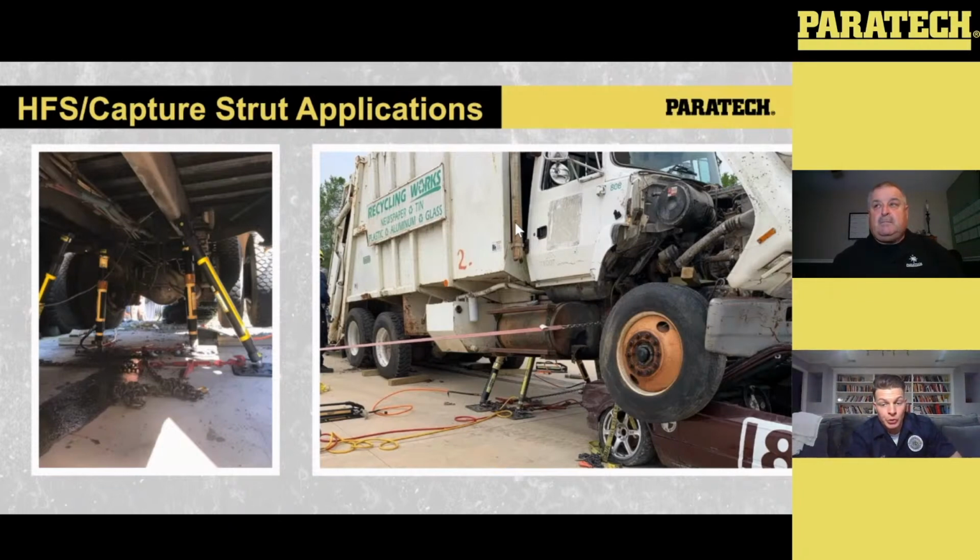So in this case, when we go to do the lift, because that front axle, that steering axle of the commercial vehicle is impinged on that car, as we start to lift that heavier vehicle, that axle is going to want to play out. So that needs to be stabilized as well. The other thing we have in play here, we're using ratchet straps in this picture, but you can use ratchet straps, grip pullers or grip hoists, whatever the case may be. I have a preference to use grip pullers because I can let slack in and out as needed. But again, that tieback's not taking a ton of load. It's just there to stabilize the vehicle from wanting to move one way or the other. So as you start to do that lift, you take away that surface contact, which is taking away that friction. That vehicle may want to shift one way or the other. You have to be incredibly mindful of the tiebacks on either side.